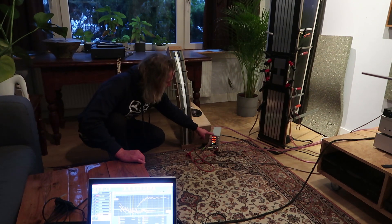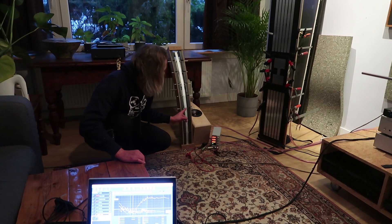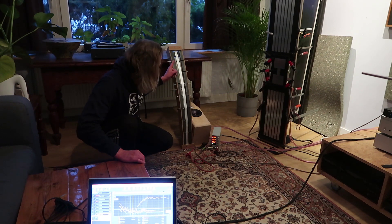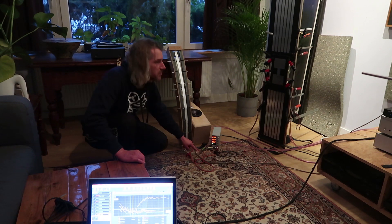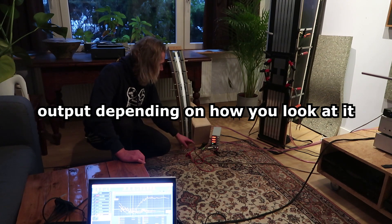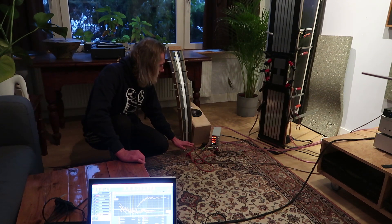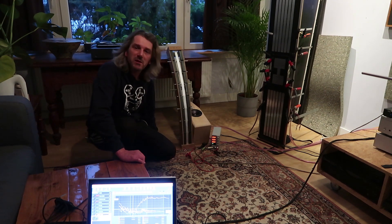So there is power coming from here through a resistor, then it's attached to the ribbon, then a cap and then the input signal from the amplifier. The other side of the amplifier is just connected straight to the ribbon - in this case positively, but I don't think it matters - directly to the ribbon.